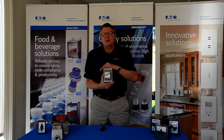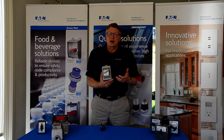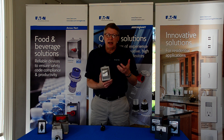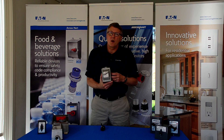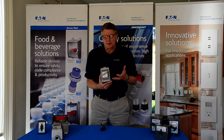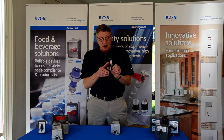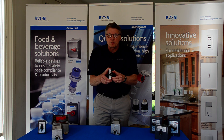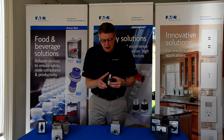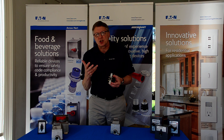This is also NEMA 9, which means that it's dust-tight. It's a cast iron electrical galvanized enclosure with an aluminum acrylic paint, and as we know, iron has 61,000 psi compression strength. On the inside of the switch, there's a small strap that's been nickel plated so it's corrosion resistant, and the contacts are a double contact, which gives you better heat dissipation.